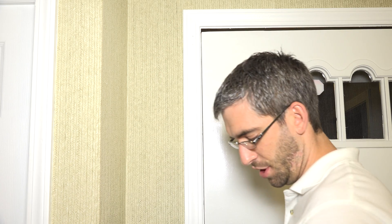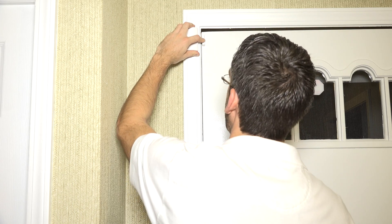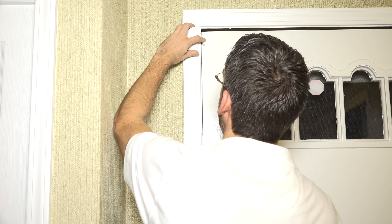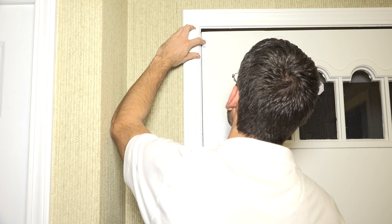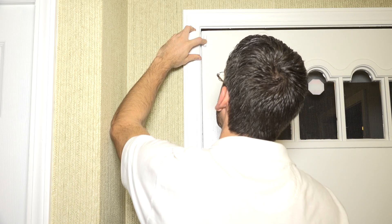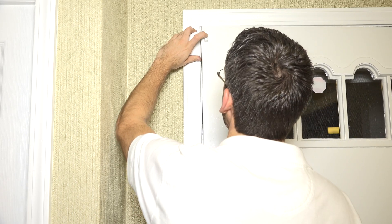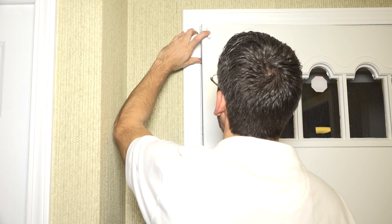When determining your installation spot, before permanently mounting it, you really want to test the door opening — which would fault the system — and the door closing in the position you plan to use. You may need a helper for a third hand: have one person hold the magnet and another hold the sensor, then do a few open and closes to confirm you'll get good triggering of a fault and a restore at the panel.